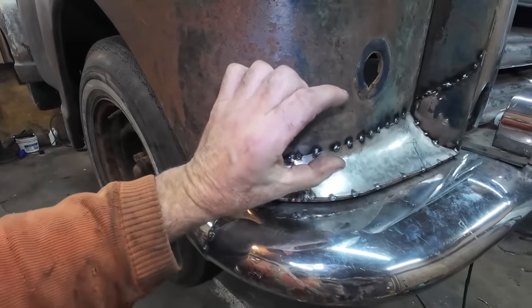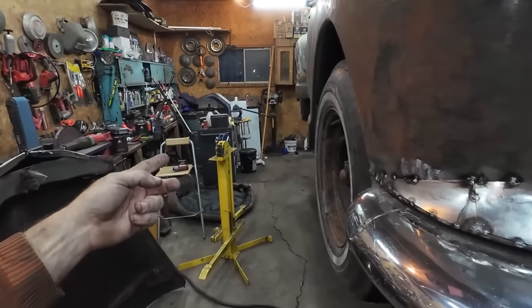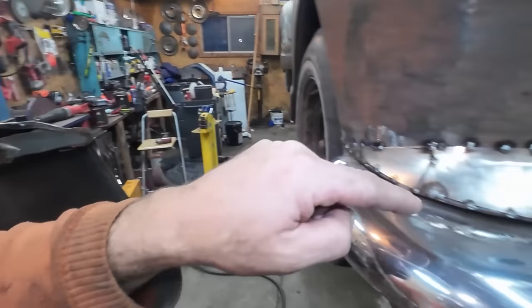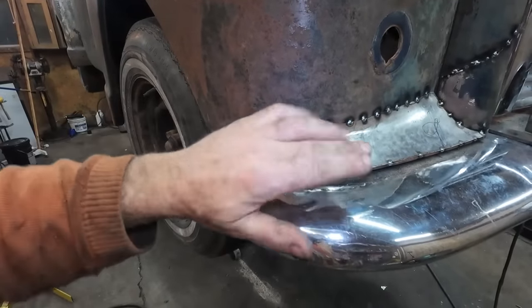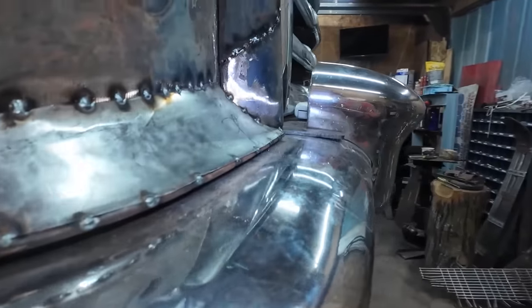When you try to go, it was just a little too much material up in those spots, so just hit it with the kick shrink there, or kick stretcher. That's what we were doing. So that ended up making this panel want to go this way. Then we just put it back in the planishing hammer a bit, just to get the curves to go around. Other than that, like you can see, it's nice.